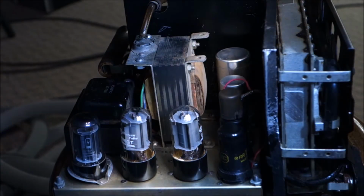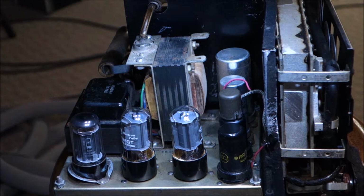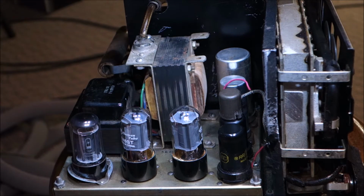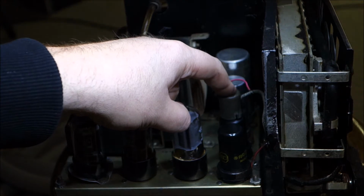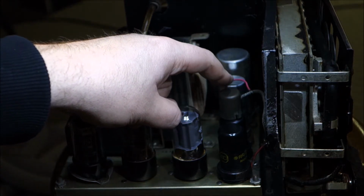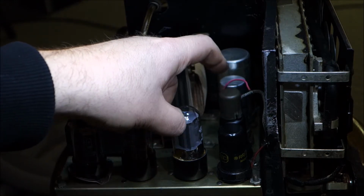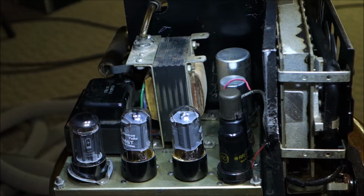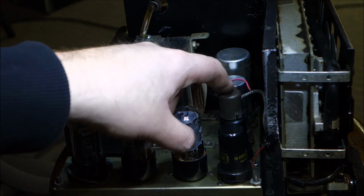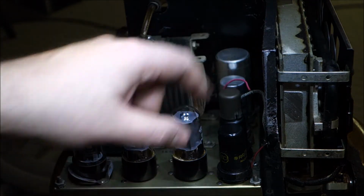Okay, so here we are back at our adventure. We've reassembled the scanner unit's chassis into the main unit here, and we have the 6J7. 6J7 is a new old stock RCA. The wire for the top cap popped off the clip, just broke when I picked it up, so we trimmed and resoldered that, so that's okay. And this top cover is like a shield to ground to help keep noise off of that, because the grid, the input of this tube, is on top.